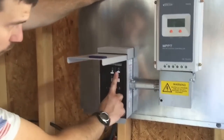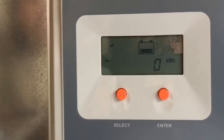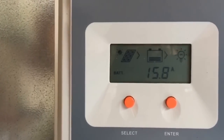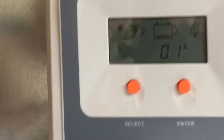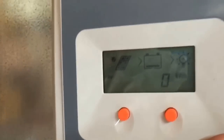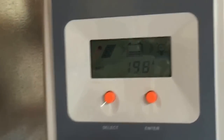Now we're going to turn on our 40-amp breaker, which is going to fire up the charge controller. This system is also EMP-ready, so you can get the additional controller changeover. We're going to turn on our solar feed. We can see our battery bank level is 12.4 volts, and we can see that the solar is feeding in. The controller cycles quickly through its functions and displays — it's showing amperage and load readouts. It's a pretty neat controller and I'm really impressed with the output on it.